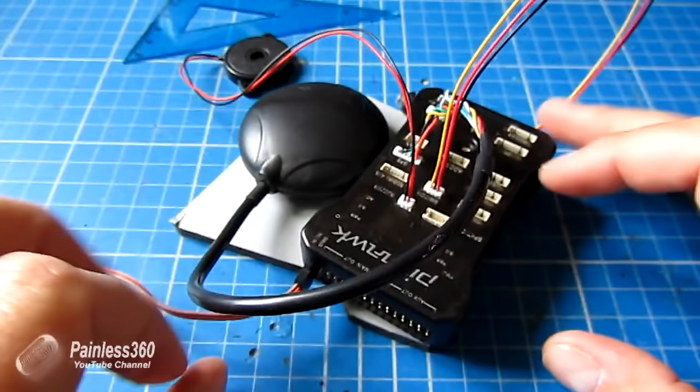We've made sure that the two arrows on both of the devices are pointing in the same direction. That way, as I move things around to teach the software what level, up, down, left, right feels like, it won't be getting conflicting information from the two sets of sensors.